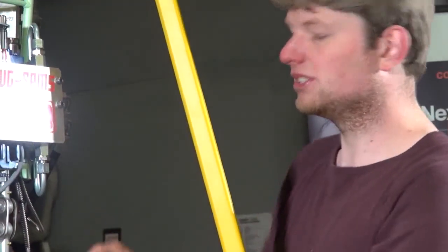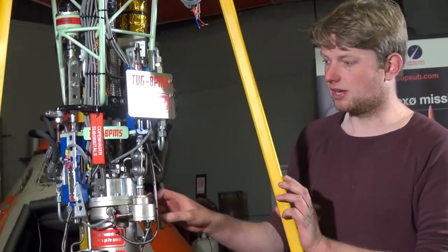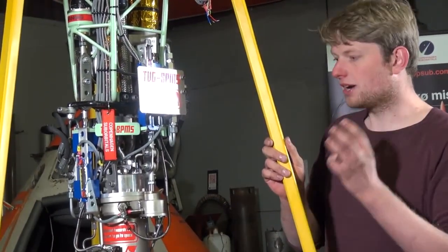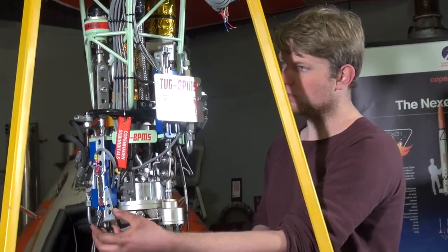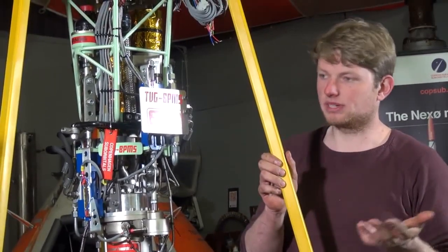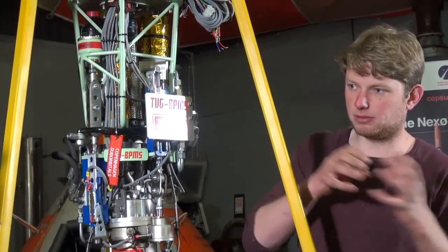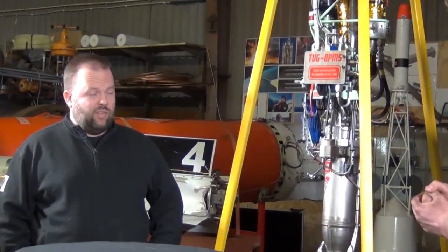So a little further up, this thing has to be gimbaled — how do you accomplish that? It gets interesting because if you look at some of the amateur guys who also do gimbaling on similarly sized rockets, they have a so-called cardan joint: the rocket engine has almost a wrist-type joint on top which diverts the thrust into the rocket itself. The problem is that we have cryogenics on the Nexo class — a liquid oxygen line and a fuel ethanol line. A standard cardan joint would require the LOX line to be routed alongside the outside of the rocket engine, and if you then gimbal the engine you would have a huge strain and flex on the LOX line at minus 180 degrees. That's not a nice environment for a flexible hose.